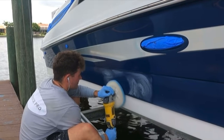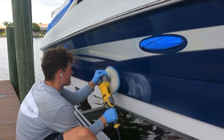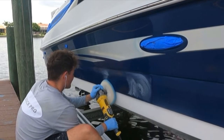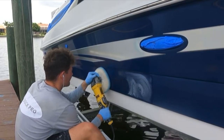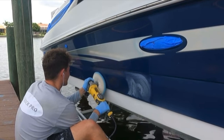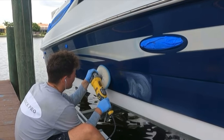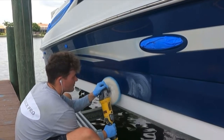This pad heats up heavily, which allows you to take out a lot of heavy scratches. Over time, depending on how you're washing your boat — is your boat banging up against your dock — all these scratches are going to get created. This gives you the best opportunity to take those scratches out because the wool pad heats up and gets really hot. When that happens, you're able to heat up the gel coat, move the gel coat around, and take out oxidation.